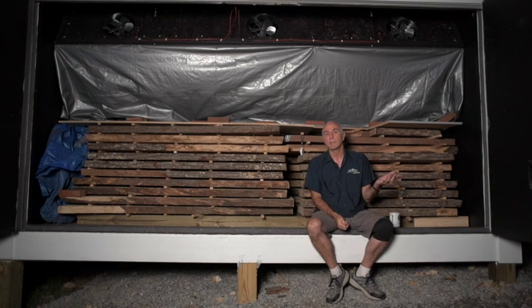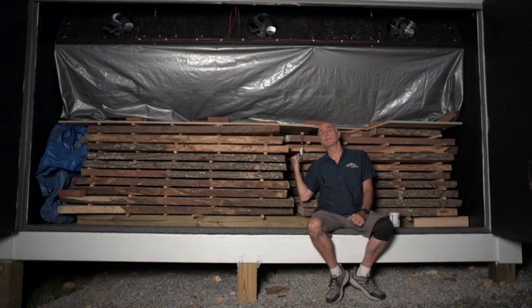Today will be a good example. Middle of October, but we are supposed to get into the 80s today. I've got a thermometer, hygrometer hanging up inside the kiln. I've got one underneath to compare temperatures, and I'll post the information at the end of the video, but you'll see that the temperature inside the kiln is still good for drying even after the sun goes down.